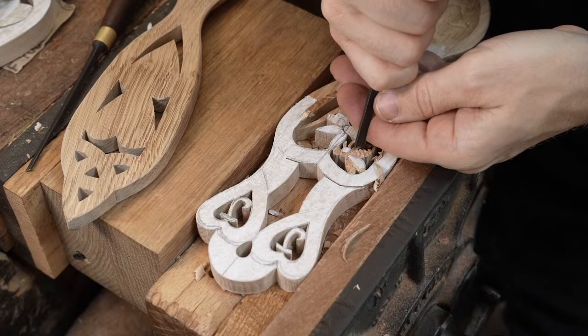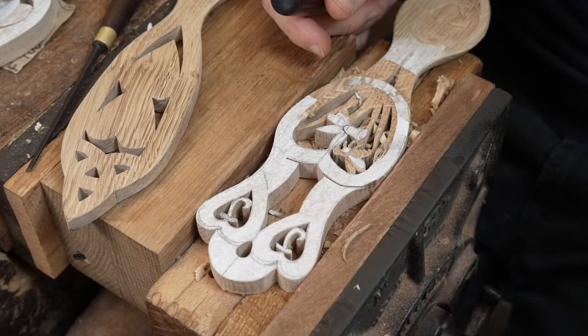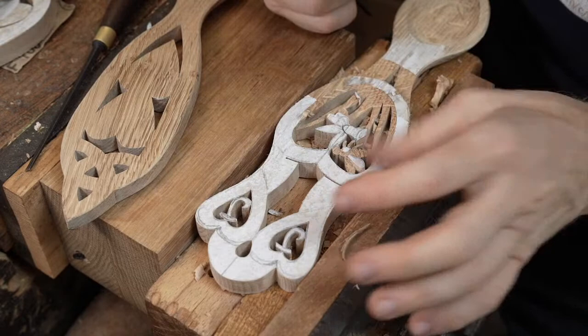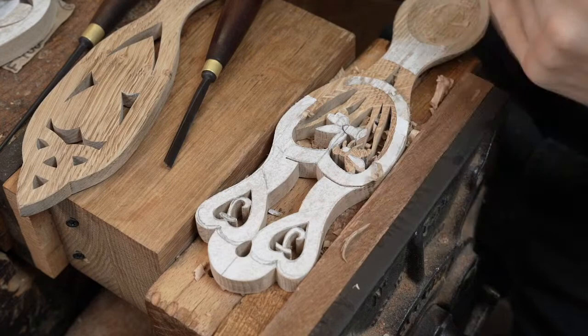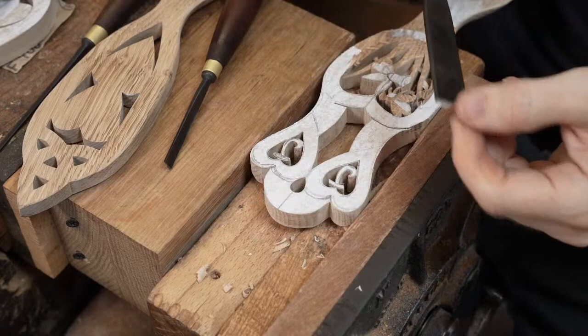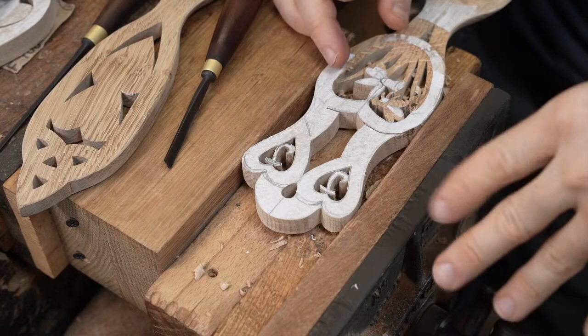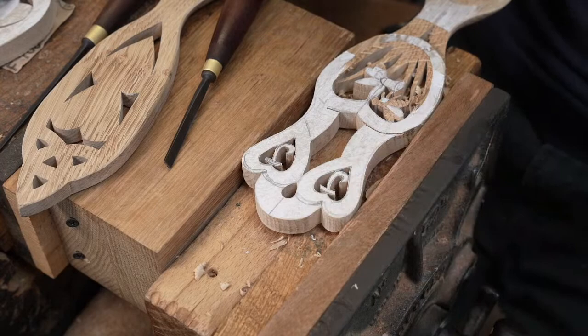Yeah. I'm thinking of different examples now with this question of tear out. You think of different situations. I always think, for instance, of sapele. I don't know if everyone's worked in sapele, pardon the pun. But in sapele, you'll get the grain going in different directions. Sometimes I found in sapele that I will start carving, for instance, up the edge on one side, and a chunk comes out. Now when you're learning to carve, that can be quite off-putting and you're thinking, oh, what do I do? Now I just instinctively turn it round and carve it the other way. And sometimes you turn it the other way and you'll have even more problems carving it.